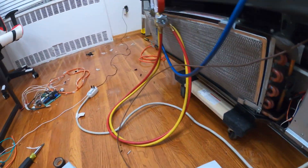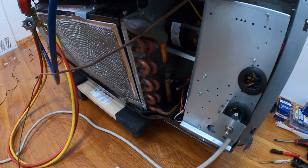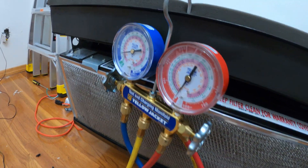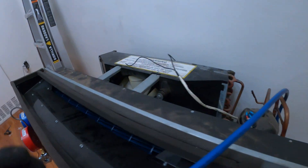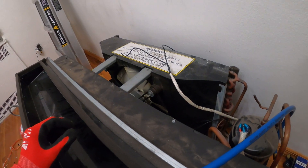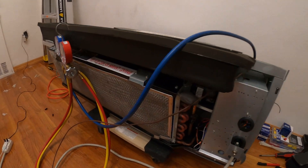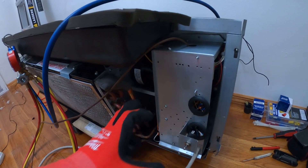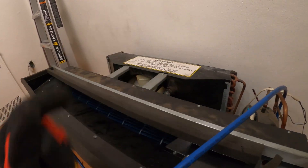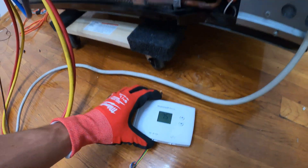You are able to close the panel back up, and here is the main cover that you can put back on, so everything is going to look like it was previously. We will be searching for a leak — I only have pressure on one side. This is a 410A system and it's only recommended to install a bullet-piercing valve on the low side for 410A systems. We were able to get this going by changing out all the controls. The evaporator fan motor, compressor, and condenser fan motor are all still good. If you found this video interesting or helpful, please drop a like, comment, and subscribe — catch you all next time.